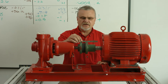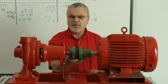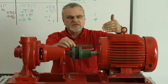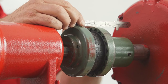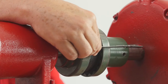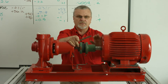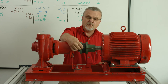By roughing in vertically, we're going to close that gap up, and what you need to be mindful of is that whenever possible, you always want to do your vertical first. Once we establish the vertical elevation on this motor, we can slide it back and forth as far as the motor bolts and holes will let us go, and it won't change this very much. But if we got it in side to side perfectly and then found out we had to shim it, we're going to put a pry bar into this motor and pick it up, and when we do, it's going to move and change. So get your vertical right first, then work on your horizontal.